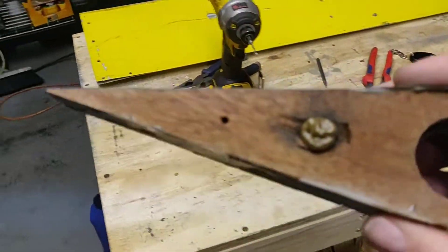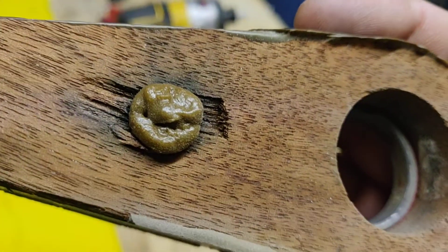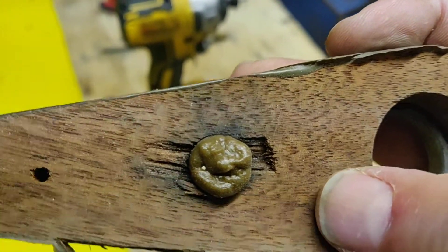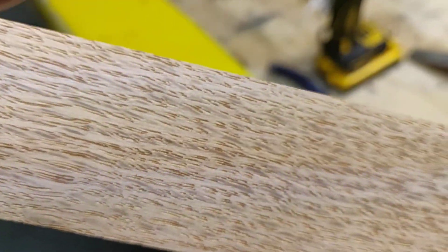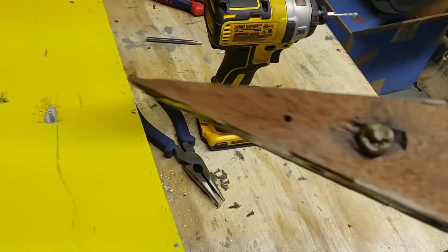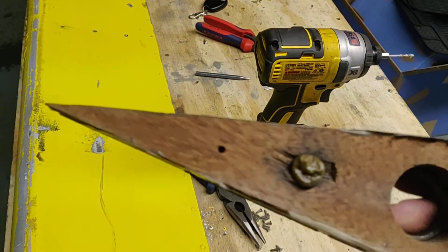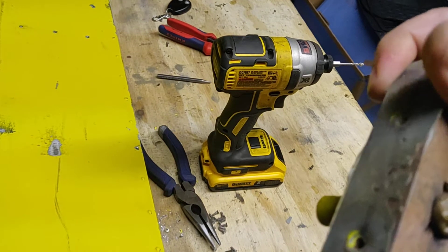Problems. One — this is red oak. How do you know it's red oak? See all those little bitty dots? That's red oak. Here's a piece of red oak — it has those same little bitty dots. This doesn't have any protective coating on it, where that has hopefully been given some sort of protection. Per the plans, this is supposed to be mahogany. From what I've learned, the reason you want mahogany is because red oak doesn't like some adhesives.